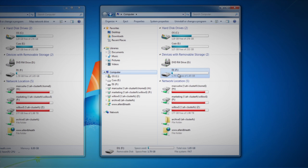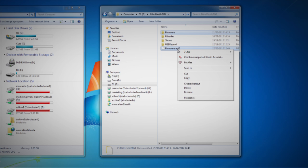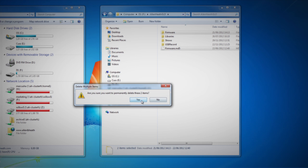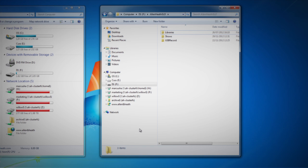Use a key with at least 40 MB of free space. Delete any existing GLD firmware on the key as described later in this video. The firmware file transfer must not be interrupted — failure to complete the transfer may result in firmware corruption of the GLD. Make sure the mains power and connecting cables are reliable and the system will not be disturbed or switched off during the update. It's good practice to regularly back up your shows to a computer via a USB key.